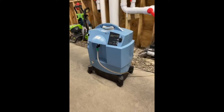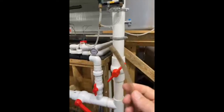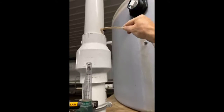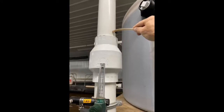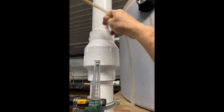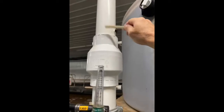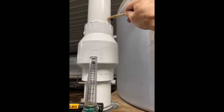Coming off of this machine, we used to inject it into the pipe and run this machine right into this pipe. Two problems with that: the pressure of the pipe was fighting the pressure of the machine, so it was hard to get the oxygen to flow. And then it didn't have much contact time before it was into the water and it would just vent.